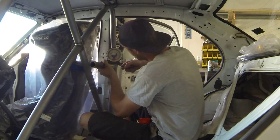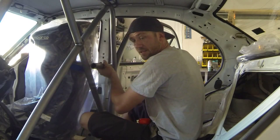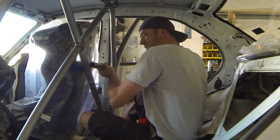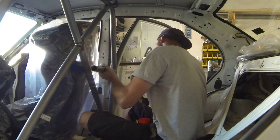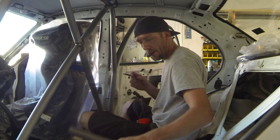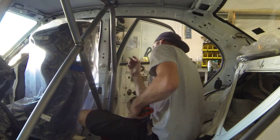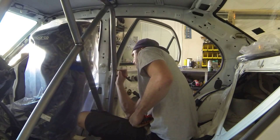Right about here I've got 10 degrees; if I go up to the top I've got 30 — so either way we slice it for GTA, we'll still be within the rule books. At the 10-degree mark, I'm going to mark the center section of the tube and then measure from the bottom to my mark. I've got 23.25 inches to the center of the tube.